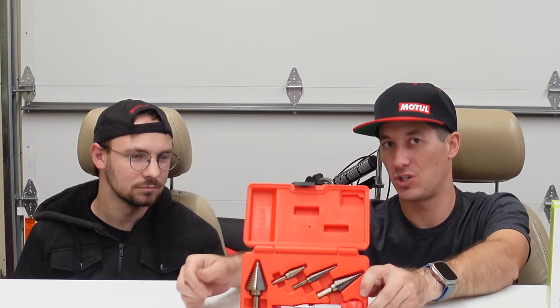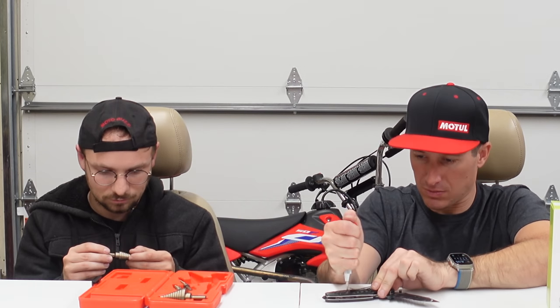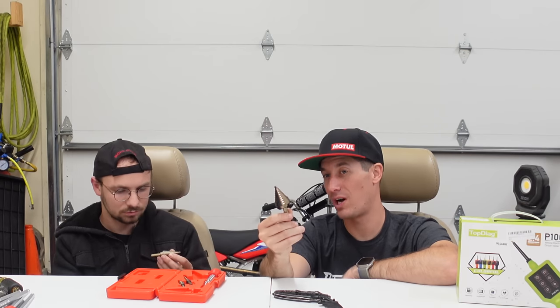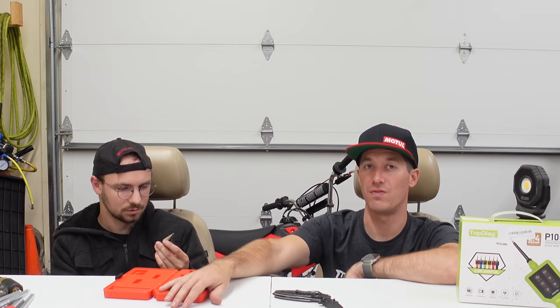This is a random one I bought simply because I didn't have an impact center punch. There was an impact center punch on Amazon for $20, and then there was one with three massive step bits for $21 — a lot of value for one extra dollar. Step bits are obviously pretty expensive and the reviews say these cut stainless steel very well. Here we've got four step bits and an impact center punch. I was just buying a center punch because I needed it in the shop — whenever we're drilling holes it's nice to have. It punched a nice hole — a drill bit would bite that no matter what. The center punch was literally the entire price, and I've destroyed quite a few step bits drilling stainless, so I was happy to have another set.